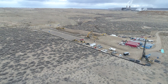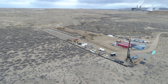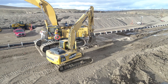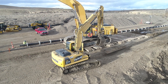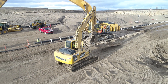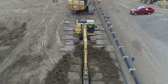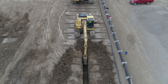In 2018, GeoSolutions installed a groundwater recovery trench using the biopolymer slurry trenching method. The trench was excavated using a 125-ton excavator with a custom long-reach attachment, working from a platform of compacted soil and timber crane mats. The first step for each cut of the trench is to dig with a smaller excavator and build slurry containment berms.